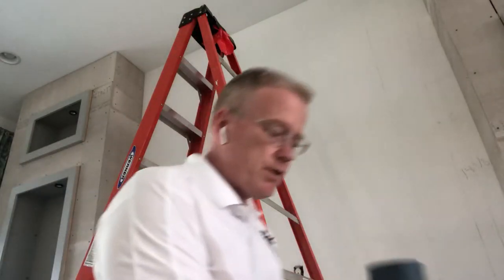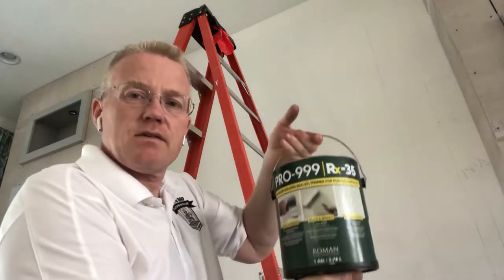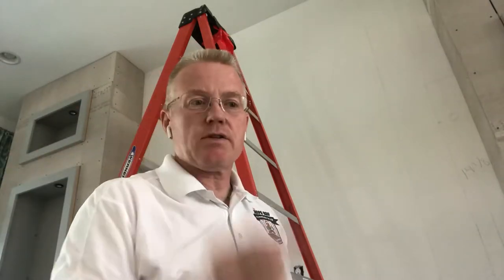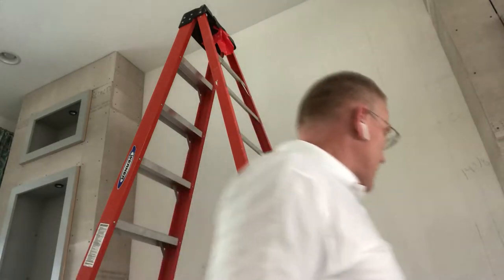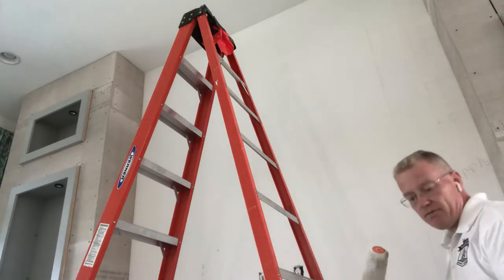What I'm going to do first in order to make this installation work is to put on a membrane. This is the membrane I chose to use — it's a very good material. You could add a little water to it if it's too thick; sometimes, depending on the humidity in the room, this stuff has enough water in it. If the air isn't moving and you put it on too thick, it'll start coagulating and drying in forms of drips that you have to scrape off. This is from Romans — it's called Pro 999 or RX 35. You can probably only find it at your local paint store; sometimes Lowe's or Home Depot will have it, but it's hit or miss. I'm going to put it on the wall surface.